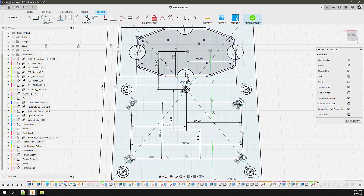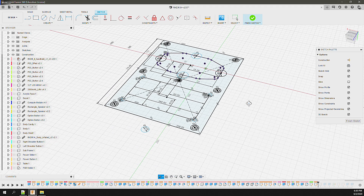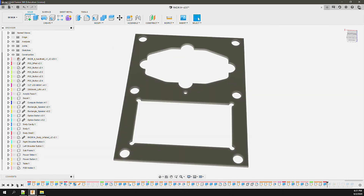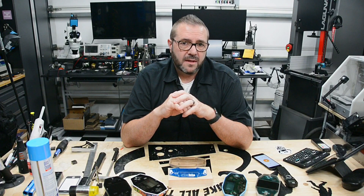This body when finished is only two millimeters thick, so if it's off by anything, things aren't going to go well. Putting the two profiles in a sketch and arranging the work coordinate system origin centered between them, I'll set the zero once and when flipping the stock for the second side I'll be good to go. All milling operations will reference this origin. To mount the jig to the work table I've added six mount holes to the sketch, then used simple extrudes to create pockets and mount holes — pockets are four millimeters deep in an 18-millimeter jig.